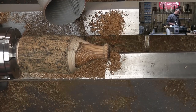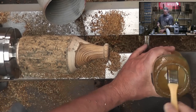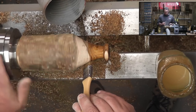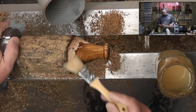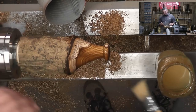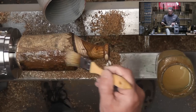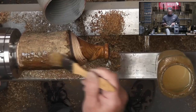We're going to put a sanding sealer on. We're going to pick out the sanding sealer as well with a little bit of wax afterwards. But watch this. The colours just jump with our sanding sealer. And it just emphasizes even more that lovely contrast in the colours. All right, even that little bark edge. Like I said, we'll do the bark as well to seal in any bits that may be thinking about coming off.